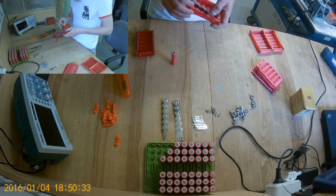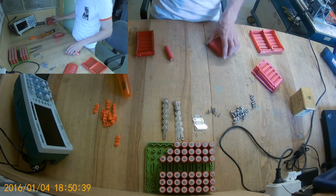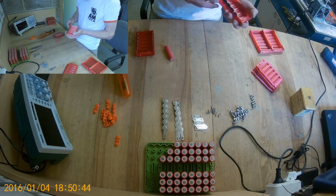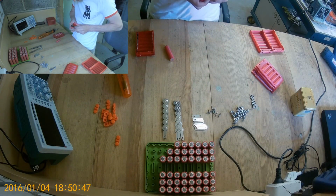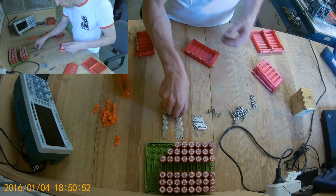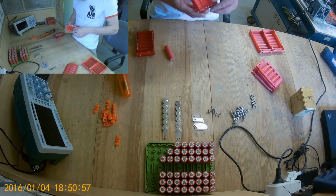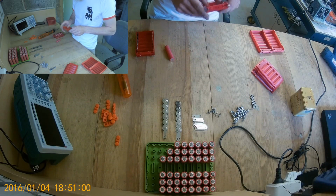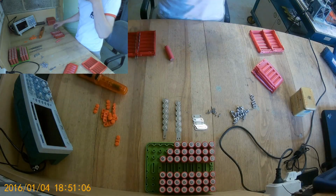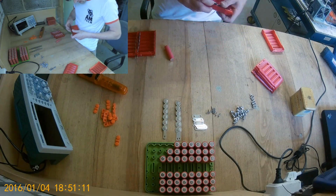If in some case the modules would get damaged, you would bend back the tabs, and probably reheat it with a gas torch, just to anneal the copper, so it goes back into a previous state where it's soft and not brittle. Now this one is fine, so it must be just a printer error in tightness. Mine is probably 0.2 millimeter.